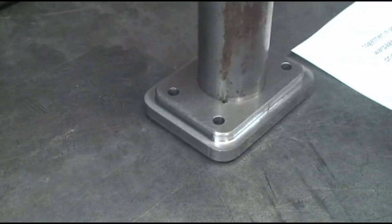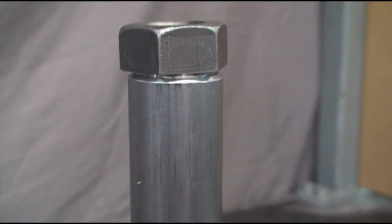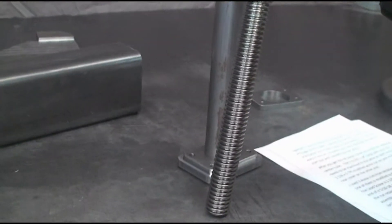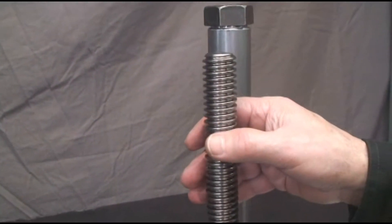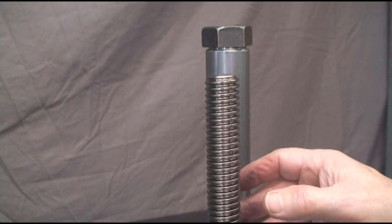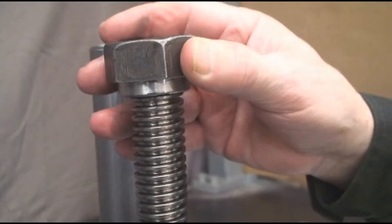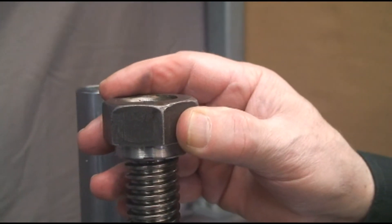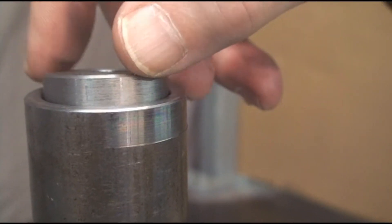When you're done, this all has to fit together nice and square — really true, and square to the face, so that when it's bolted up in here it fits up tight and square and nice, with this centered. To do this, you want to use the threaded Acme rod, which has a 5/8-18 hole tapped into the back of it. You want to screw it into the nut just a little bit, about an inch, and then you can use the screw in the back through this washer that you will have made, to hold it centered in here and keep everything lovely.